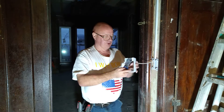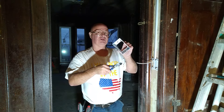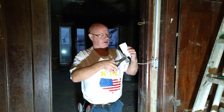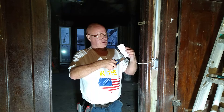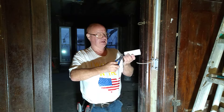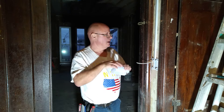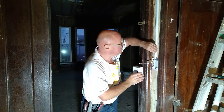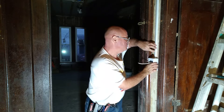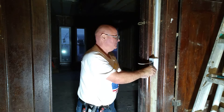On your plastic wire mold boxes, you'll see the little notches inside for the different sizes of wire mold. We're using the smallest one, so we're going to take our cutters and cut a little notch here, rake it open like that. We're going to make sure our wire mold is sitting in the box the way it's supposed to, then slip this over — there are tabs that grab onto the box to make sure it's in all the way.